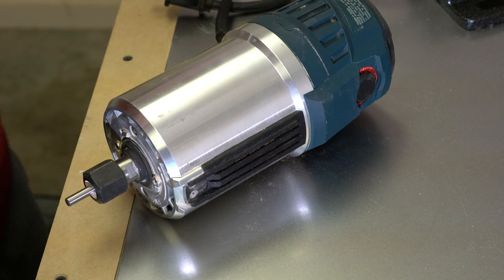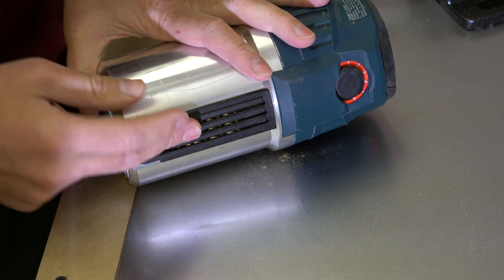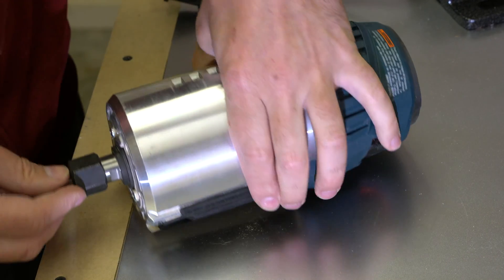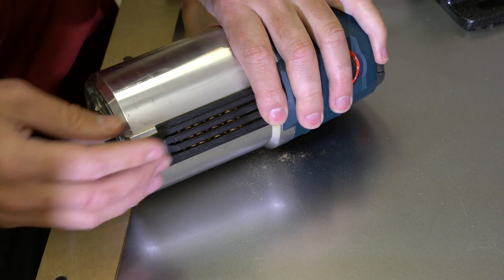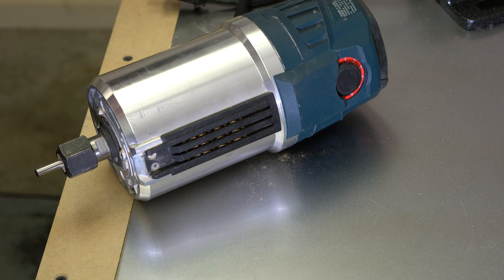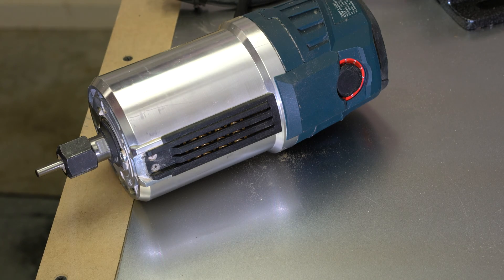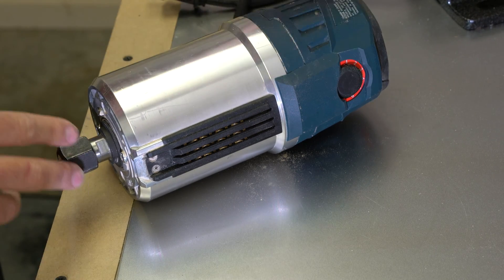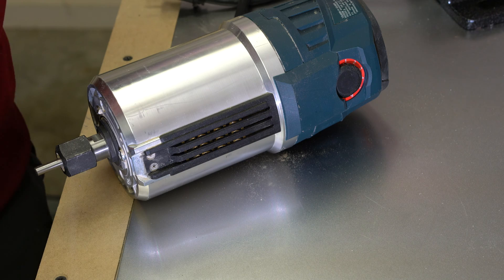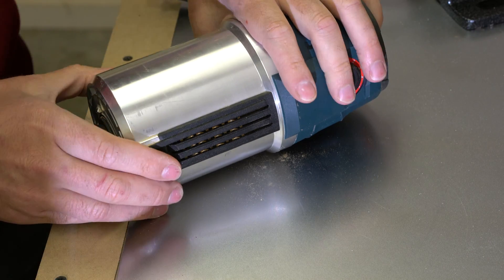The microchip says you've not pressed the switch even though it's just powered up, and it prevents it from powering on. It also stops metal getting in here and just starting it by accident — rolling it over on some wires or whatever. The microchip stops it even if you just short these out. So to actually turn it on, I'm planning on having a look inside, but I'm sure there's a microchip board I can take out of the handle, wire into these three contacts, and then wire that into the Arduino start, or just have a switch to keep it simple to start with.